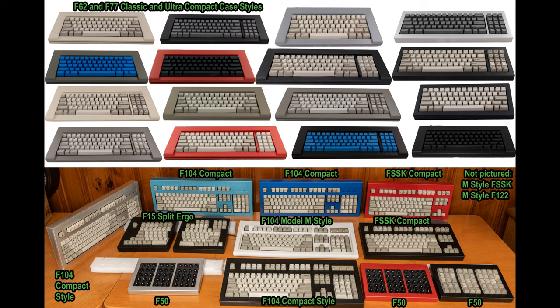Now we're ready to install the rest of the keycaps. Please do not plug in the keyboard to your computer until you're instructed to later on. The steps in this section will describe everything you need to know about how to install the keys, how to evaluate the sound of the spring as you test each key to make sure it actuates properly, how to reduce the buzzing sound of a key, and how to fix a key whose spring does not click or buckle as it is pressed down. It is completely normal for many keys not to function on your first try. Keep watching to avoid frustration and reduce your setup time.